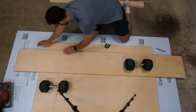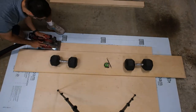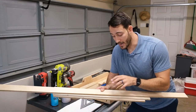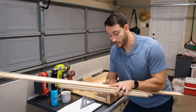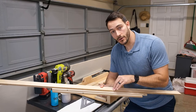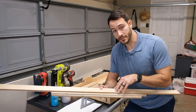I need two of these four-inch pieces, and the third piece is going to be a half-inch piece. I've got this half-inch birch plywood scrap left over from another project, so I'm going to use this for the shelving portion. But I'm going to show you all how to cut this with a skill saw if you don't have a miter saw.